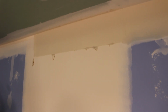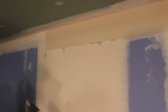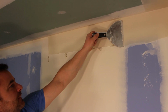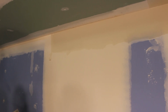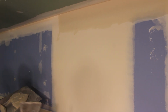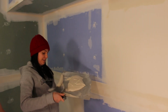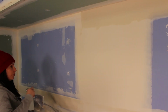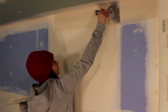Right? Do one more wipe. Then we've got to cut this off. So I would just put all the weight like this, Camille. See that? You want to finish it? Finish it. Let me see if I can. You don't need any more mud. You don't need any mud. One final wipe. You've got to get it nice and flat now.